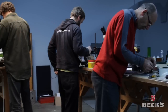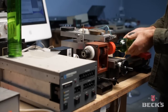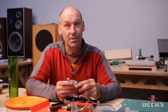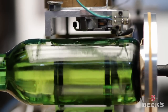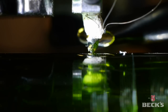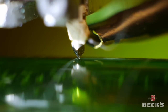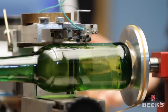The next hurdle was a device for cutting into the bottle — that being a lathe, basically a lathe tip. The main reason for using a hard drive arm, which you see here, is it cuts in a true transverse path, as opposed to a standard recording lathe that does up and down movements and side to side. And because modern music has a lot of bass these days, the needle would tend to bounce out of the groove. So using this system it does allow us to get a lot of bass energy into the track.